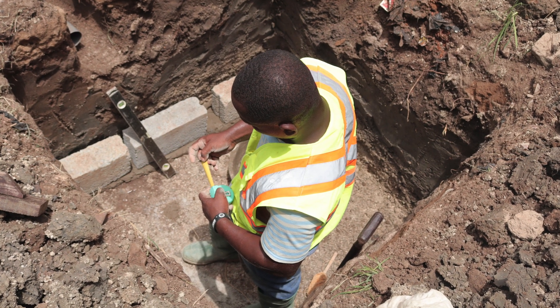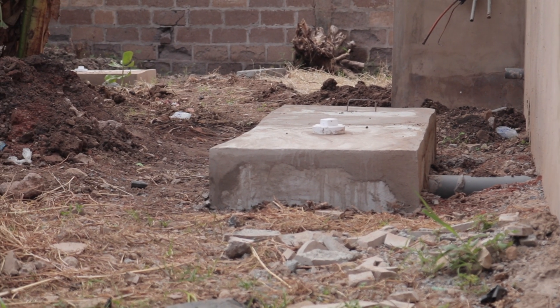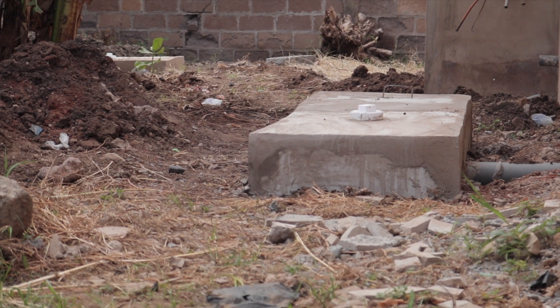The overflow pipe can be connected to a longer or bigger drainage at the other side of the area. We were also going to leave an overflow pipe so that in case there's a problem — which sometimes you have to envisage when doing biodigesters — that can be sorted out with a clean-out pipe on top of the soak away. That can help address the issue of wastewater not seeping into the ground. The truth for this particular house is the land is not good. When we started digging we realized it's more clay and it wasn't going to soak if the capacity of users exceeds a certain number.